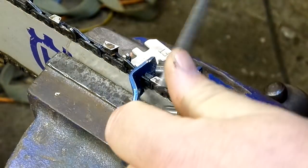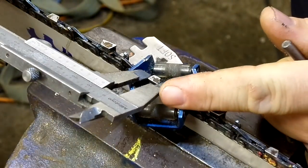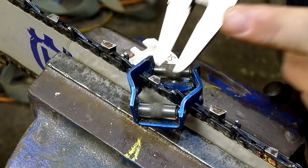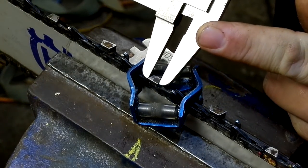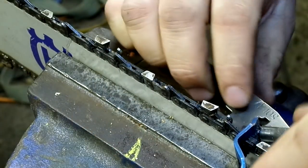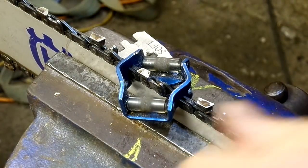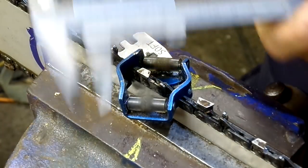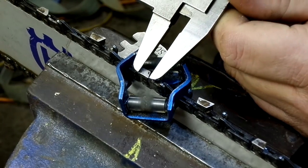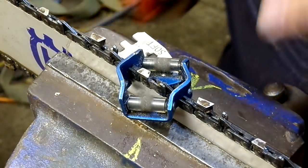There we are, perfect. Look at that — fitting over there. That's exactly the same. Pull it forward to the next one. We're doing it one side at a time, just turn around then. Get the vernier — this is a definite, get a vernier for doing teeth. See how much I'm out — it won't drop over the top. And with a big bar, you've got to be right.